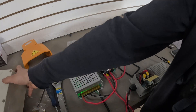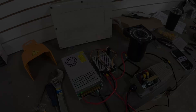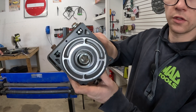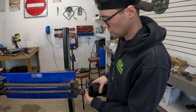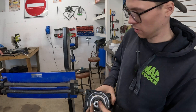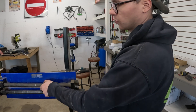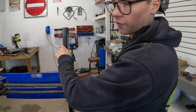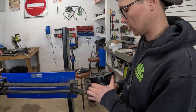Now we're going to try to mount this stuff into this box here, make it look all pretty, and then we'll try mounting this to the bead roller. I took my winch and because I just bought a replacement motor it didn't come with a coupler, so I welded a nut onto the end there. My coupler idea is to take the nut with a socket — I'll weld the socket to the bead roller so if I ever need to take the motor out I can. Before I do this, I need to brace this up more, because one of the biggest issues is the deflection in the bead roller and the stand I took from the scrap steel bin at work. So I'm going to add some bracing first.